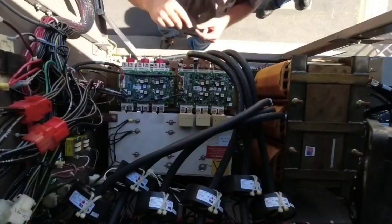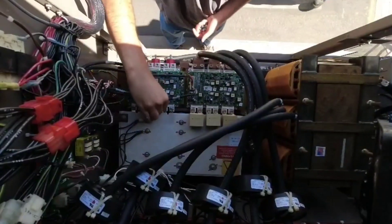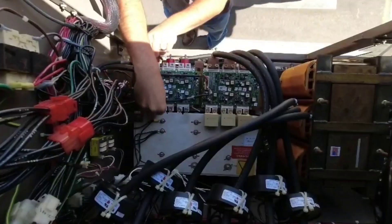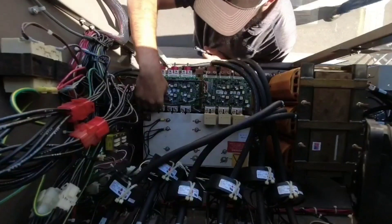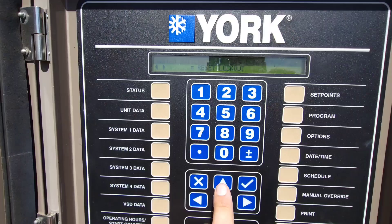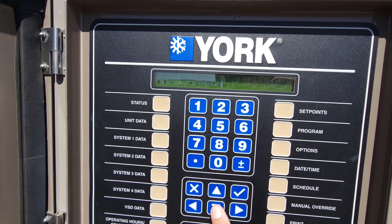Out of each IGBT, apparently they had been having this lockout for some time. If it trips — I think it's three times in 24 hours or twice in 24 hours, something like that — it locks out at that point, but it will give one or two faults before an actual lockout condition. I felt comfortable and recommended a gate driver on system one.